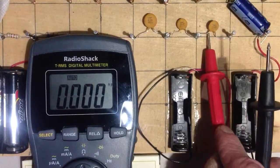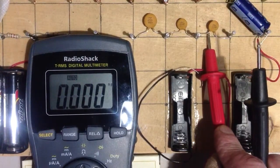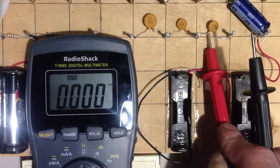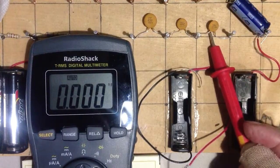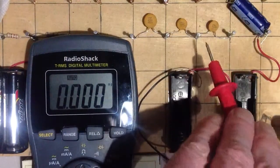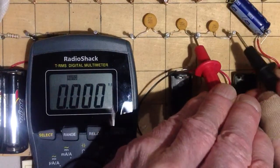These are given in microfarads. A nanofarad is a thousandth of a microfarad. So one microfarad would be a thousand nanofarads. 0.1 microfarad would be 100 nanofarads. Let's see what we get.